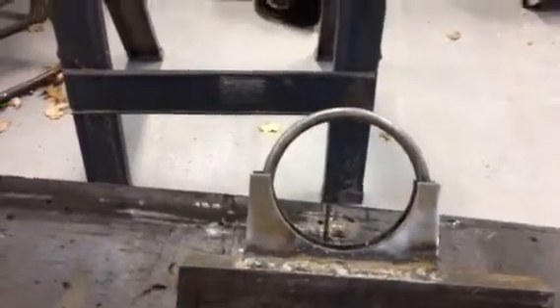The reason I did that is because there's not as much clearance on the top. I think some of the bars you actually have to cut your factory horn off of your lift block, and I don't want to do that. So I had to be right underneath of it.